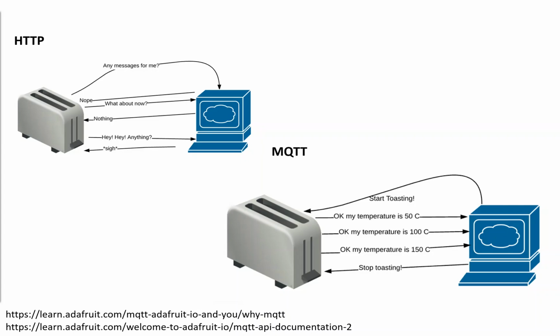In the MQTT world, what we've done here is the toaster has subscribed to notifications from the cloud service. And that keeps that session open with that cloud service. So when the cloud service is like, hey, start toasting, that toaster can then start sending publish messages saying, hey, I'm at 50 degrees, I'm at 100 degrees, I'm at 150 degrees. And then when that cloud service is ready, and only when it's ready, it will send another message back to say, hey, now it's time to stop toasting. Is everyone happy with the differences between HTTP and MQTT?